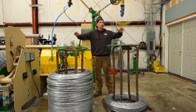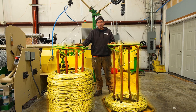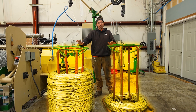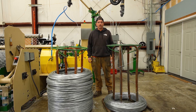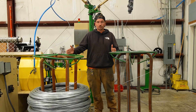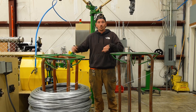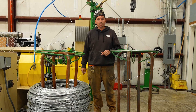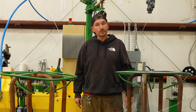We bring the coils underneath the pulley system. We've got these set up right now with 11.5 gauge strand because we're making four-foot 11.5 gauge wire. We've got these two strands in place and we're drawing them into the machine, into the forming worms and the stretching worms, to turn them into chain link. Let's take a quick look at what that looks like.